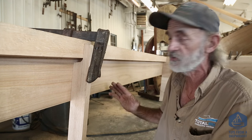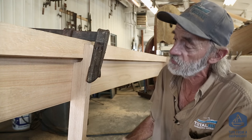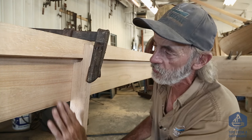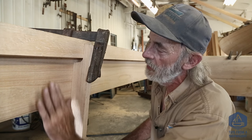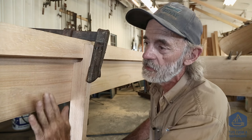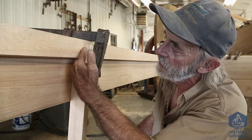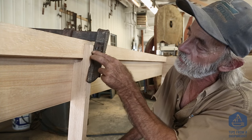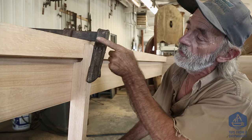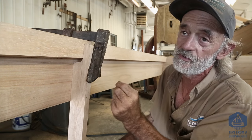There will be 14 frames on this side and 13 spaces, so that's the next thing — go set up to manufacture these frames. There's also a little roll in this side plank, a little cupping, and when you clamp it into position and fasten it, you want enough frames so it holds that little cup out of the plank perfectly. It also rolls the chine just a tiny bit so it contacts the back of the frame, and we're going to put a couple of screws up in here holding the chine and the frame together. The medullary rays are at an angle so that when we drive the screws it won't split on them.